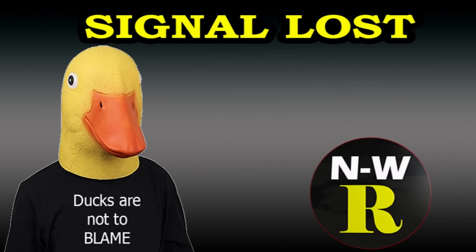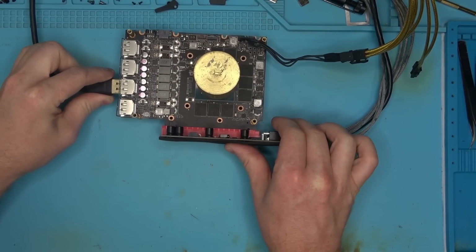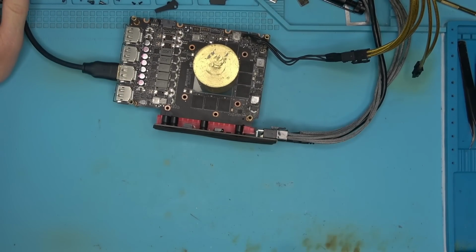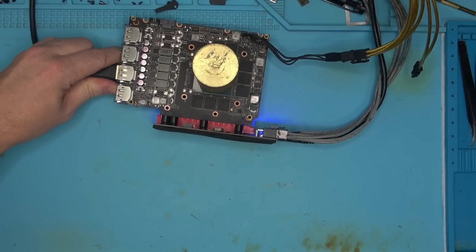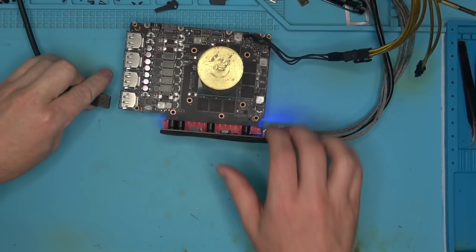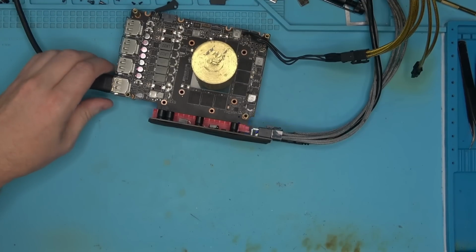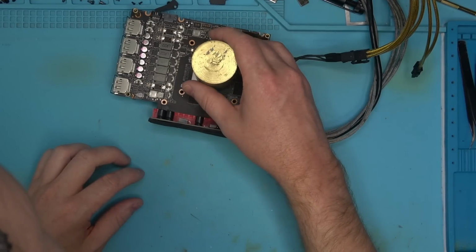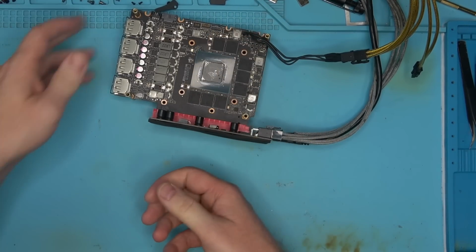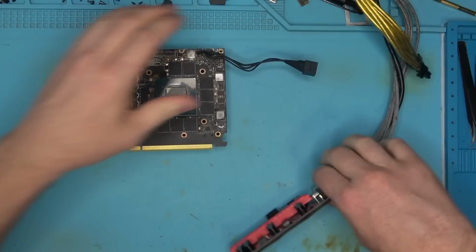how the customer determined this to be a non-functioning GPU, but as you can tell, it does not work from this port. So I'm thinking that maybe he just tried to get an image and it wouldn't post, and it doesn't even react to this port here. This port is completely busted, and so is this port. So 3 ports are busted, and I doubt that there's any problem with the circuitry of these ports, but rather rust, corrosion, oxidation, whatever.